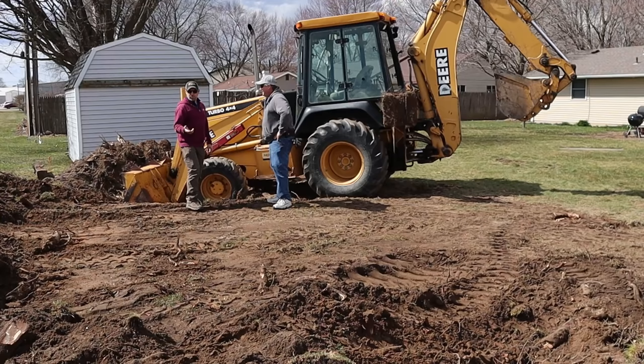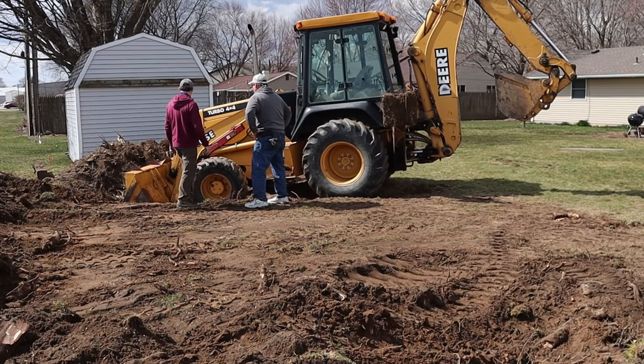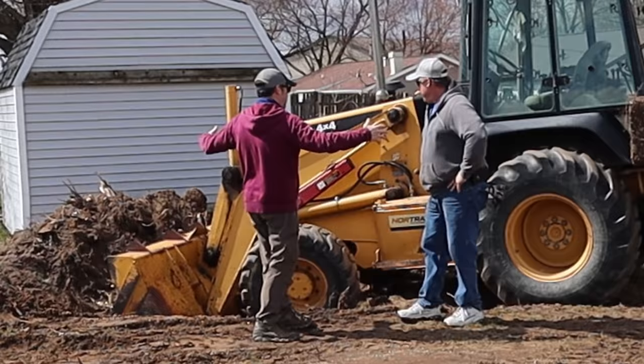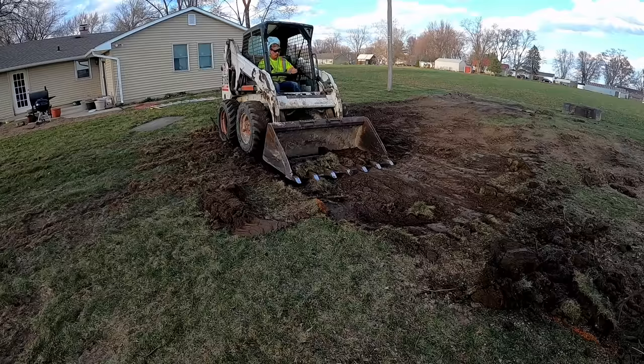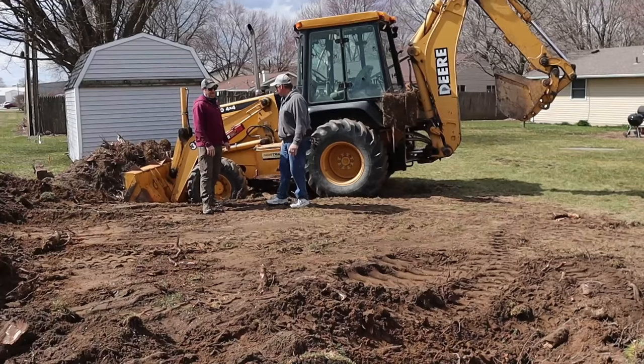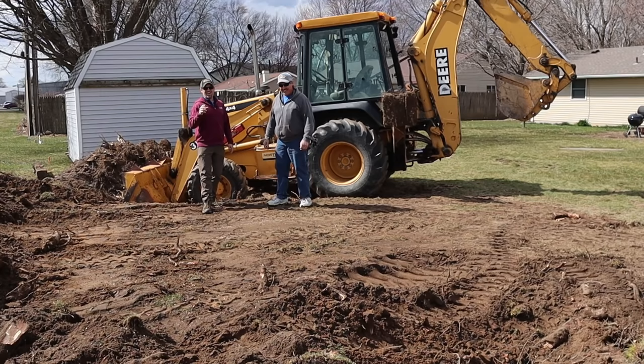That was impressive. It's at least 12 foot diameter. Yeah, it's a big hole — I kind of parked the backhoe in there so you can get a scope of how deep it is. It's huge. So what are you going to do next? I need to grade some topsoil, then I'm going to bring backfill in, get this all compacted down into where the foundation is going to be. And then you're going to trench a footer for the building. You're one step closer to getting your building done. Day by day, one day at a time.